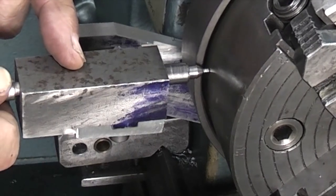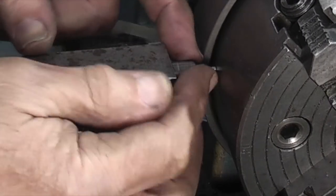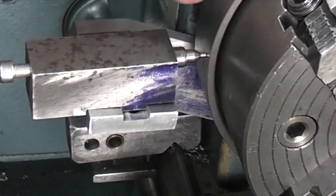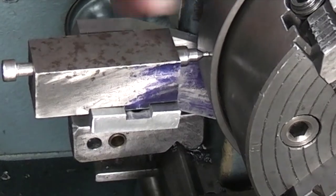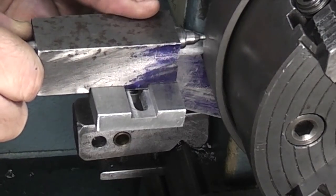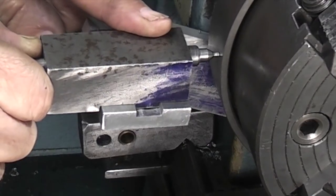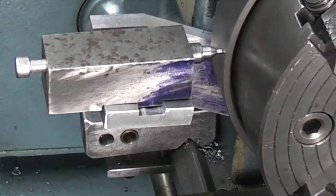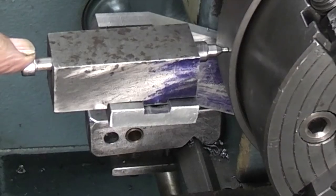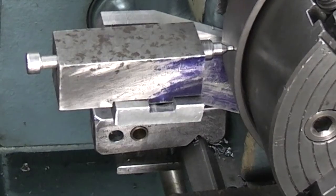So you can pull it in and out by hand, and the plunger goes far enough in that it touches the chuck, but it will go far enough in so that the 60 degree part hits whichever hole you're on. And we've got the movement on this enough to put maybe three rows of holes in this indexing plate. So in the next episode, we'll be finishing off the handle and putting the holes in the indexing plate for the first row of holes.